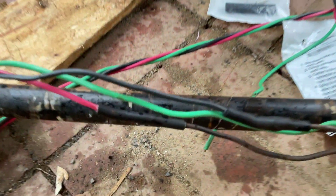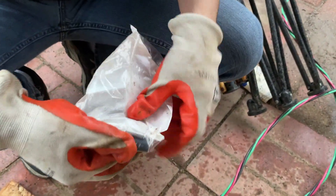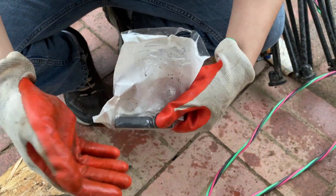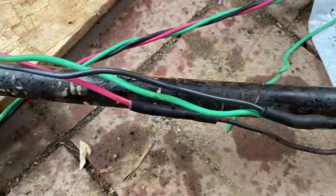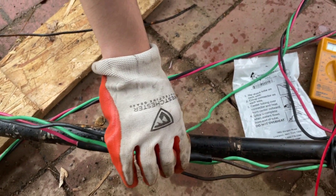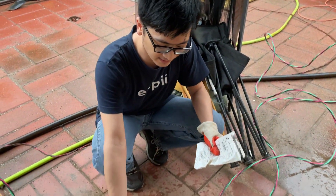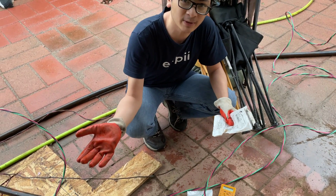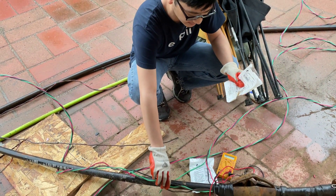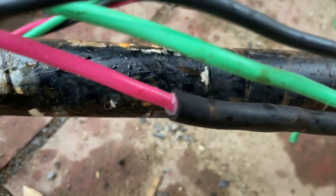As you can see here, we've cut off the old pair of the wire and replaced it with the new pair. How we did that was we took the little connector and connected the two ends of the wire. Then we put the rubber — or the heat shrink plastic — onto the end, and clamped the metal down on the wire so it'd be tight. Then we slid the heat shrink tube onto the wire and used a lighter to heat it up. Usually you want something that creates more heat, but we didn't have many tools, so we settled for a lighter. It shrunk and oozed a liquid that sealed the holes at the end to create a tight seal, because we don't want water leaking in.